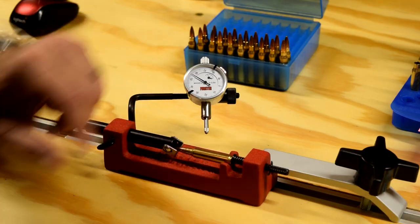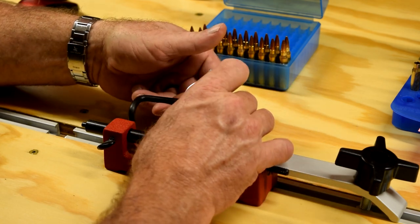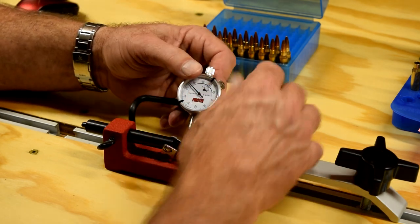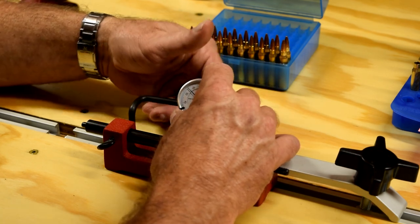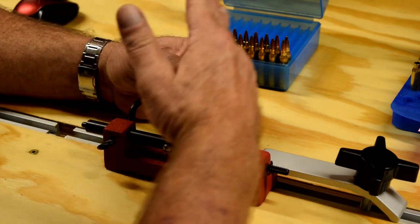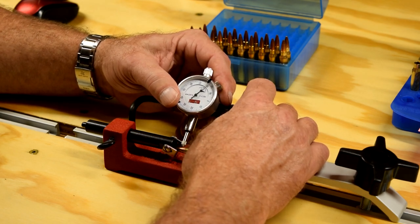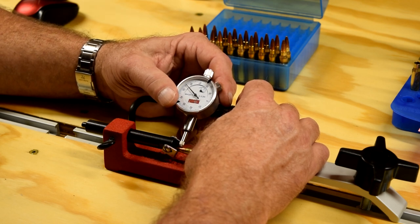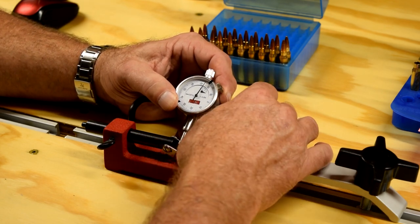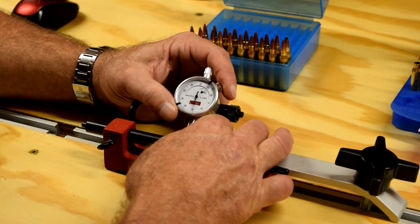See — a lot of steps. You don't have all these steps with the Sinclair. I think the Sinclair is much, much nicer honestly. And again you loosen the lock nuts back here and get it to a point on the bullet that you want to measure. Keep in mind when you tighten this right lock nut down, it's going to throw this thing out a little bit — so it's going to move. Which is kind of a pain in the ass and not a very good design feature in my opinion. But we want to load that up a little bit. We're reading about 55. Let's take that up to about 80, 85.